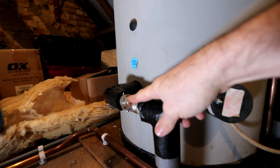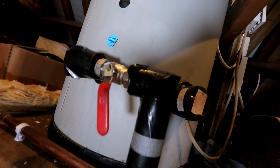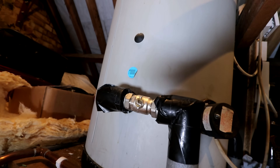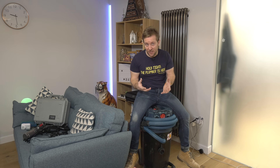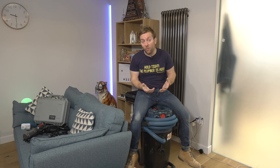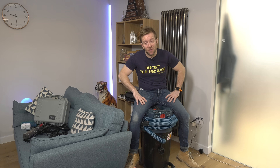This is my balancing valve - and if you look at it end-on, it's pretty much shut, which is what I use to balance the flow. Sometimes you'll also find you've got a flow regulating valve, which is a much better and more proper way of doing it, but also the most expensive - you're not going to tend to find this type in domestic situations, more in commercial property. It's very important you do it though, and I'd recommend while you've got the system drained down, check that your tank has got one. If it hasn't, cut it in and get it in there now - it's a really good idea.